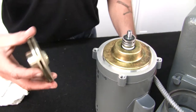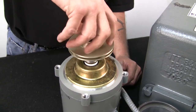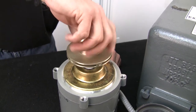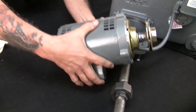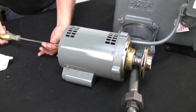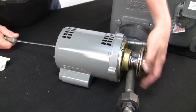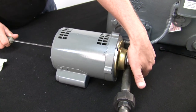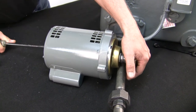What happens is when you put the impeller on, the impeller makes sure that it gets pushed down on the shaft for the right seal tension. So we'll just keep rolling here. Threaded impeller, nothing fancy — set it on and just start threading it on. When you get it tight, you'll notice that the shaft wants to turn. So we just take it and set it on its side like when we took it apart. Get our screwdriver back in the back end of the motor, get it latched, grab the impeller and tighten it. Because it spins in one direction — it's a single phase motor on these condensate pumps — you don't have to worry about direction or the impeller spinning off unless the motor is phased running backwards. Just give it a twist and that's all there is to it.